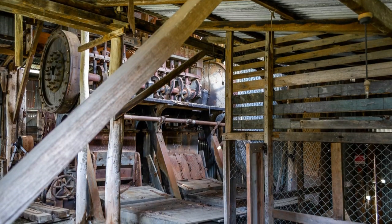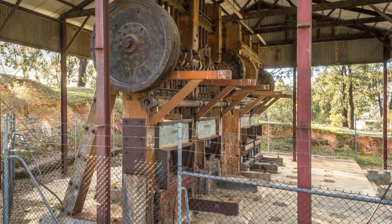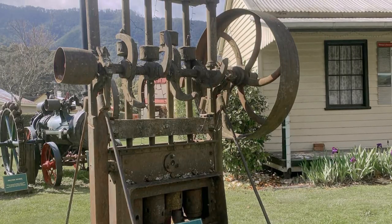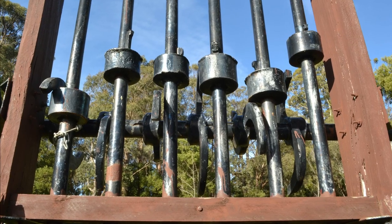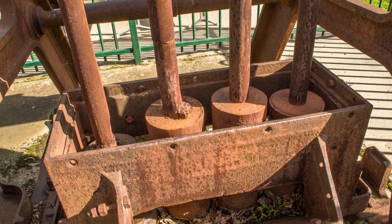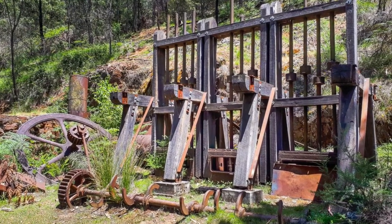So let's take a closer look at these machines and their foundations. Stamp batteries are machines which crush rock using a pounding action. They consist of a set of heavy stamps which are held vertically within a frame. The individual stamps are lifted by cams on a rotating horizontal shaft, then released as the cam rotates out from under them, causing the stamps to fall within the mortar box and crush the rock inside. This is repeated continually to crush large amounts of gold-bearing rock.